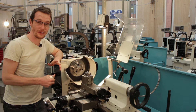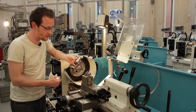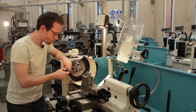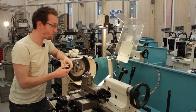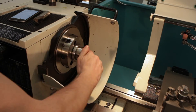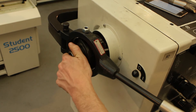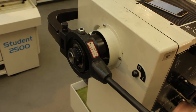The final system is the collet system, which is a specialist lathe attachment enabling really quick changeover for batch work. This is a 5C collet system — collets come at pre-ground diameters, so this is a 25mm collet, which is our maximum size. The ground mandrel is too big for our biggest collet, so we're using a 25mm milling cutter instead. We're adjusting the tension on the collet to get a nice positive engagement — perfect.